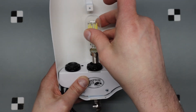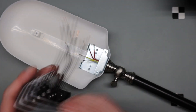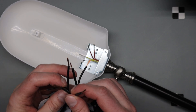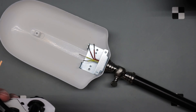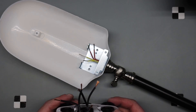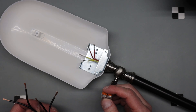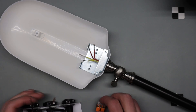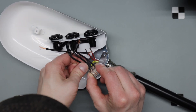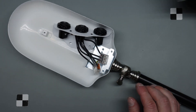These bulbs are only going to go out so far, but that'll work just fine. I just need to connect them internally — normally I'd just connect all of them together in a wire nut, but I don't have a lot of room and stranded wires would be kind of annoying. So I'm going to use WAGO connectors. I only have three slots so I'll put a couple of them together. That's locked in — none of that stuff's going anywhere. Nice and tight.